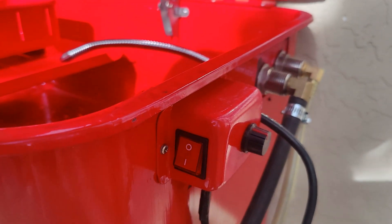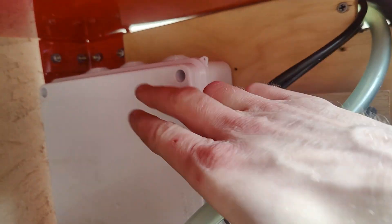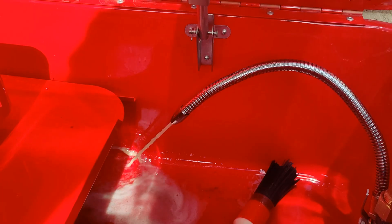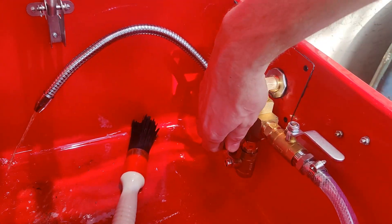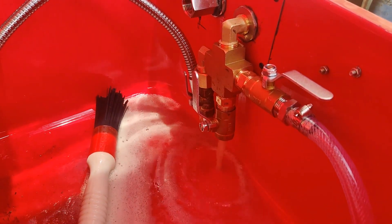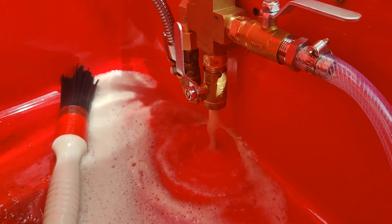You can see the dial for my motor control speed here, and the wire goes down underneath and into this white box. This white box contains both the AC-to-DC power supply for the motor and the DC motor controller. I'm not going to open the box because it was a pain to get it closed — it basically just looks like a laptop charger inside. I'll have a link in the description to all the parts I used. One word of caution: I tried a 10-amp power supply because the motor is rated at 10 amps max, but it could not provide startup current for the motor. I ended up using a 12-amp power supply, and that one works great.